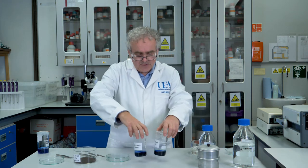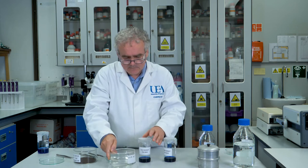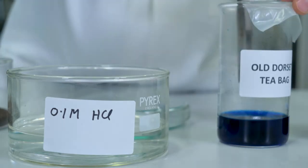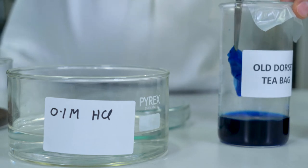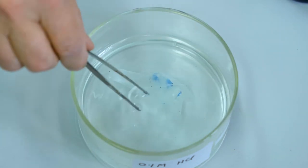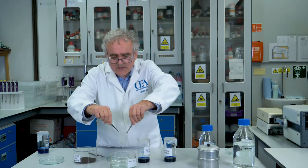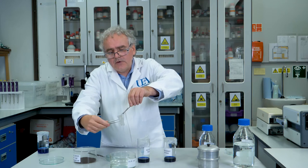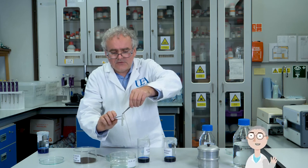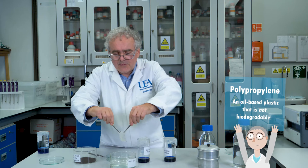Because this takes a little bit of time, I've got some here that I prepared earlier. And if I look first at the sample of the old Dorset Teas tea bag, if I fish around in here, I can pull out a skeleton, and I'll rinse this off in some acid solution to get rid of all that copper ammonia solution. And what we're left with is a complete piece of material that looks like a tea bag. And this is actually the complete polypropylene skeleton of a plastic layer, which is inserted into the tea bag as part of the manufacturing process.